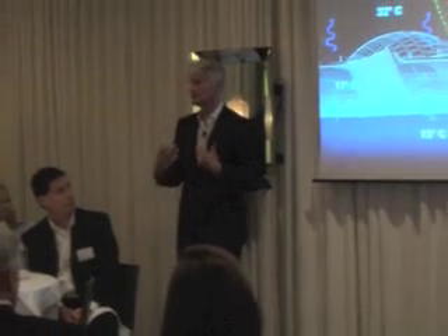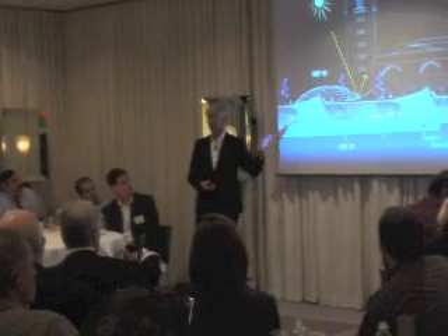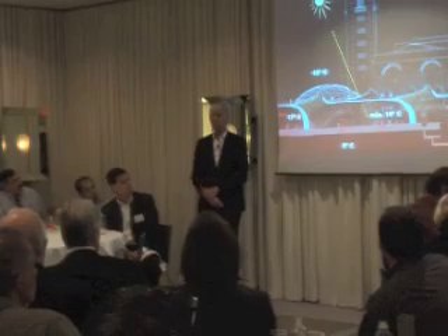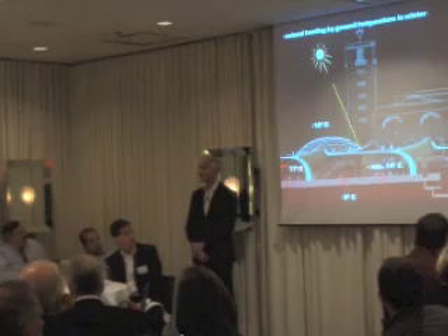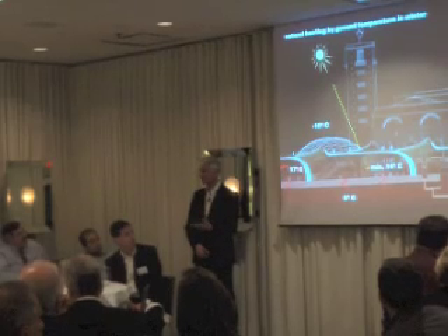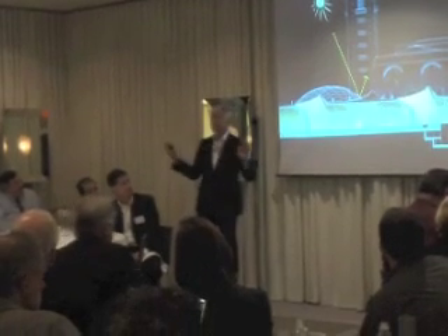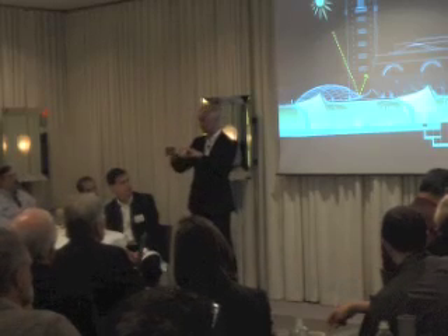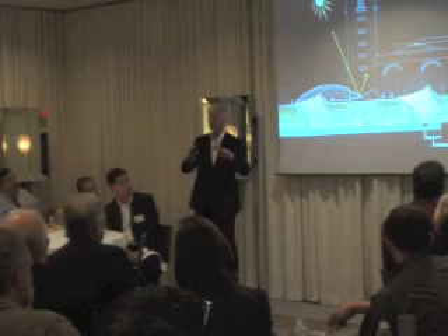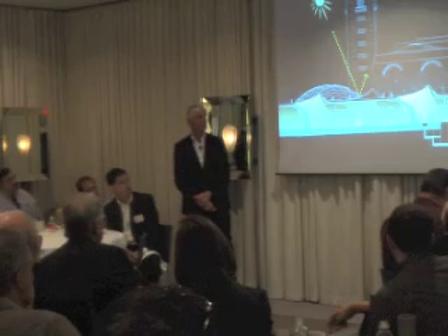At 32 degrees outside, the station stays at a maximum of 27 degrees — and you use the station dressed as you are outside. It's five to six degrees below outside temperature, which is very comfortable. In winter you have a minimum of 14 degrees, which is also very comfortable. So no additional energy is needed for heating or cooling. We also have photovoltaics on the roof of the existing station, and the 28 light eyes provide excellent daylight — measured at the Technical University of Munich to be just enough.